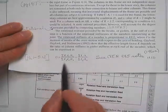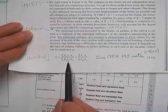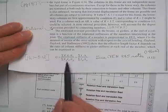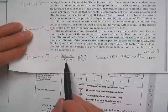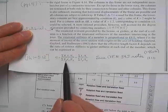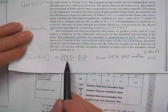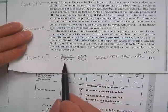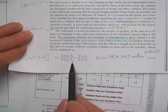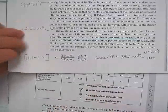There's one ratio for the top joint and one for the bottom joint. Since E is the same for steel throughout, the ratio is expressed as the sum of column EI over L's divided by the sum of girder EI over L's for each joint. When you do have concrete columns and steel girders you use two E values, but we don't get into that here.